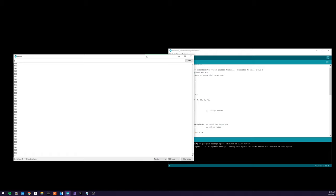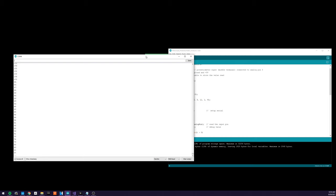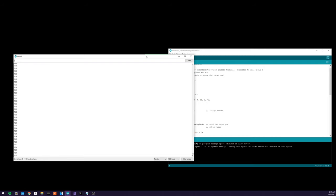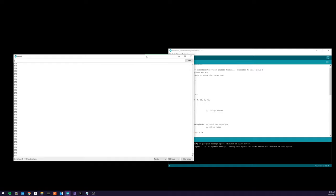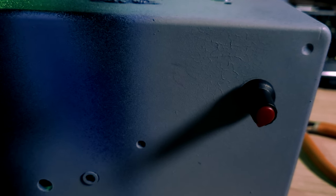The circuit is the same as before, and I'm capturing the screen to show the serial monitor, which is printing the value of the potentiometer inside the box. Because both pots are tied together, adjusting the knob adjusts both. You can get values from 0 up to 1024 — 10 bits of resolution. I can also use the serial connection to save a target position and command the potentiometer to go there: send 's' to save, 'a' to activate. Let's set a value at 578, send 's' to save, adjust to a different position, then send 'a' — and it got pretty close.